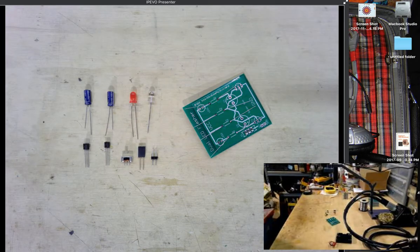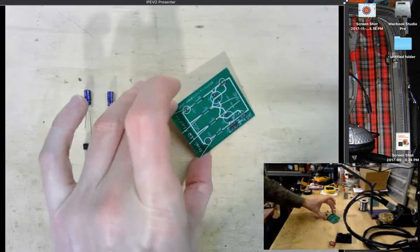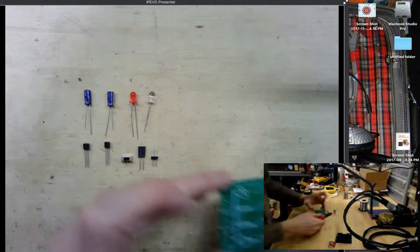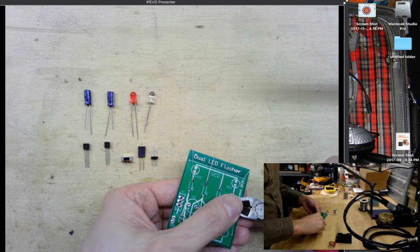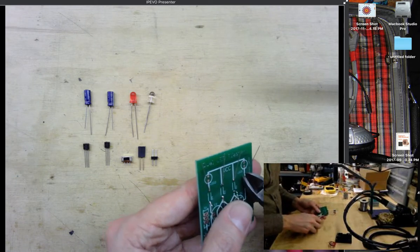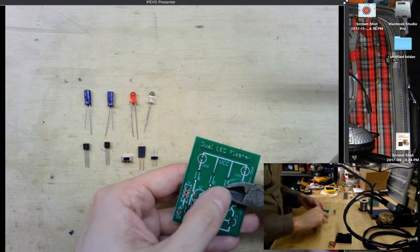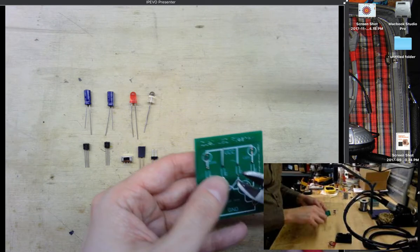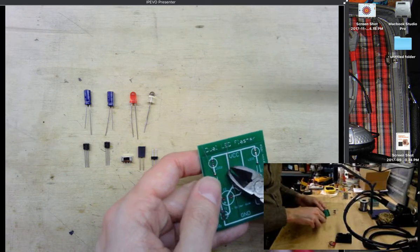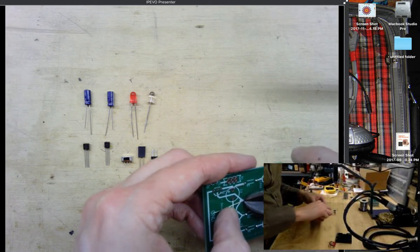Now that we have all of these solder connections made, let's trim up those leads and move on to some other components. So here I just have some normal wire cutters. Flush cutters work a little bit better than these to get into the board, but you just want to make your cuts right on top of the solder connection without necessarily cutting through the solder itself.